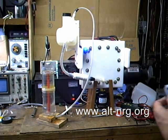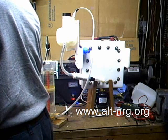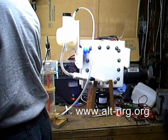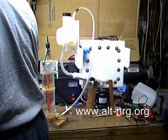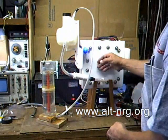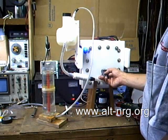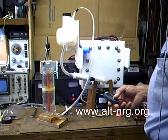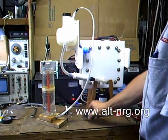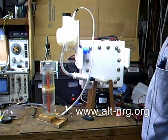Off camera, I just posted a reading at 410 watts. I got 2.1 liters per minute, so 2100 divided by 410 is 5.12 milliliters per minute per watt efficiency. The efficiency is going up slightly. My cell temperature is only 94.3 degrees Fahrenheit. It's fairly warm out here in the garage — it started at 90, and this has been running for almost half an hour now. So the amount of heat generated from this cell is very, very small.